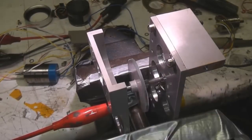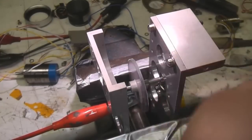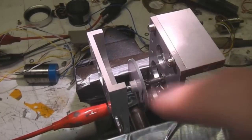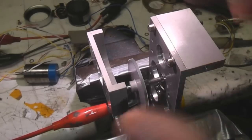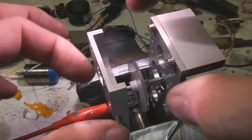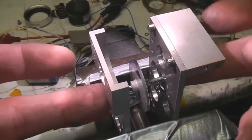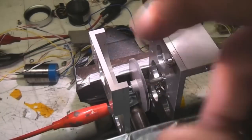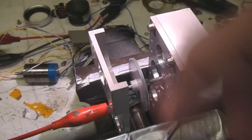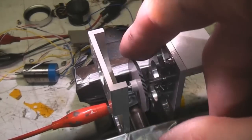Now, one interesting thing you can do if you've got some nice ball bearings and a shaft, generally it's bigger than this, but I'll be interested to see how this one works because it's very free flowing, is make a ball bearing motor. Now there's a little bit of controversy about how these things actually work, but basically all it is is 2 ball bearings and a shaft, electrically insulated from each other on each side, and the shaft just needs a little bit of weight to act as a flywheel. You basically apply a high current from the outer ring of one to the outer ring of the other, and you can do it the other way if you've got a tube across it, but basically the current flow across the 2 rings of the ball bearings produces a rotational force. Many years ago I wrote a web page on this, which I'll link to here, but it's one of those fun little completely useless things, just a quite amusing little gadget.